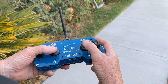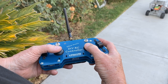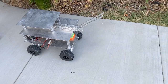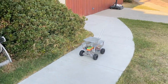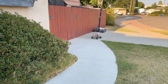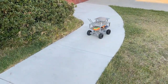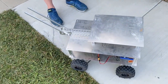With that, the programming is done — you are done. The controller can still operate as a traditional RC controller and should work with motor controllers that accept an RC input. We've tried it with the ServoCity motor controller and a couple of others, and we're still testing it on additional motor controllers. In the future we'll have our own that'll be added onto this board, but in the meantime you can use it with a lot of the other controllers out there. I'm using it on a new prop I'm working on — if you have any ideas what it might eventually turn into, leave your thoughts in the comments.